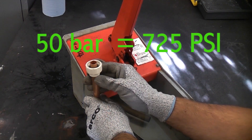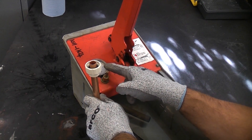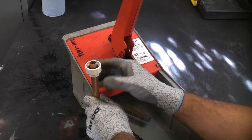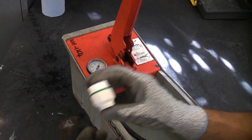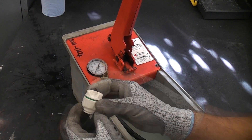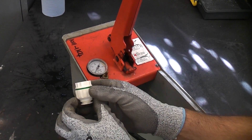I have to say that I'm quite impressed with that. It did take over 40 bar — I'm pretty sure it went nearly 50 bar before the fitting actually failed. You would never get anywhere near that kind of pressure in a domestic plumbing situation. So to be perfectly honest I was quite impressed with the amount of pressure it could take. People often say they don't trust push fit, but as I proved, they are perfectly adequate for domestic plumbing.